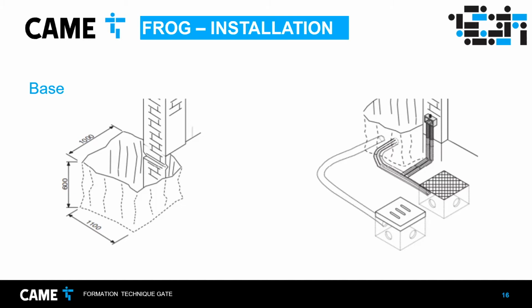And also, this is an additional thing, they need draining, because since they are underground, a lot of water is going to get there, and since it's watertight, it's no problem. But the idea is that when the rain stops, there's a way to drain that water little by little. So that's why it has a big hole in the casing. So you put a pipe, sometimes they put rocks or any kind of thing that is going to help the dirt to absorb the water. So anything that is for drainage. They show here a box with holes. That's fine. Anything that helps to drain the water.